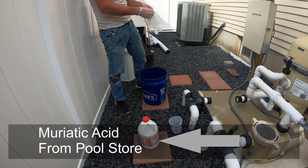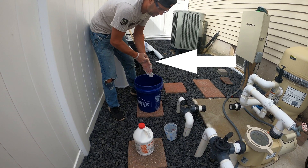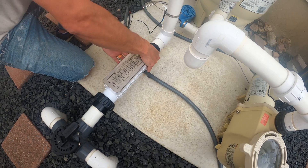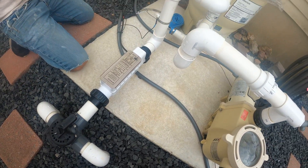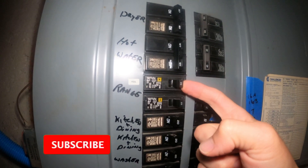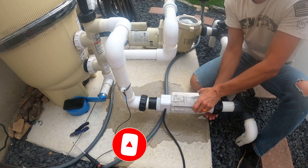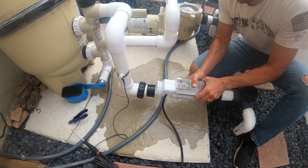It's very highly recommended that you wear safety glasses and gloves. With the safety equipment out of the way, we need to remove the actual salt cell generator from the plumbing. Before we do that, we need to turn off the power. Then we're going to remove the salt cell generator using the unions in the plumbing — you can see me unscrewing it here — and put the salt cell generator to the side very carefully.